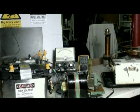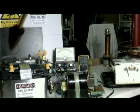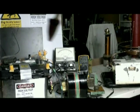Now I'm going to dim the lights — you probably won't see the meters anymore. I'll call it out as I draw the core out and demonstrate the arcs. This is going to be at 2.6 amps unloaded. When we load it, we're talking roughly about 10 amps — it's 2,400 VA. It can go all the way up to 12 amps, 2,800 VA.